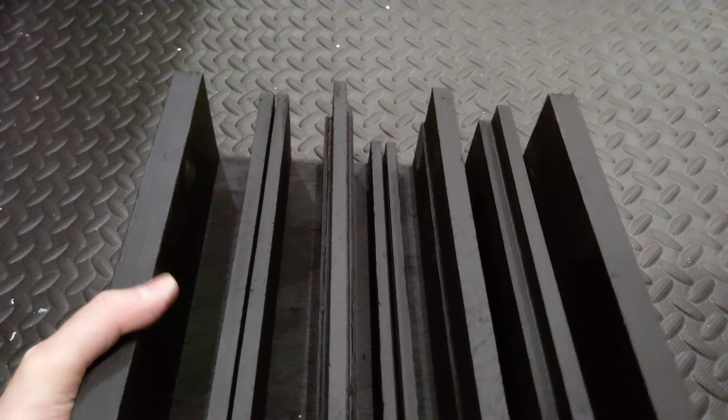If you're interested in how I made them, here's a look at the end. These are 1x4s, which are actually three-quarter by three and a half inches, and then this is a half-inch piece of plywood. There's a brace — one on the top, one on the bottom. I assembled them on the wall using 2x4s leveled to the wall with screw holes — it screws in, really simple. Then the plywood I had pre-cut, and I glued and nailed it, let it dry, and pulled it off the wall. I put a 1x4 piece, centered it, and made sure it was square in every direction, then did the same on the top and bottom. I took my router with a finishing bit that makes it flush on both sides.